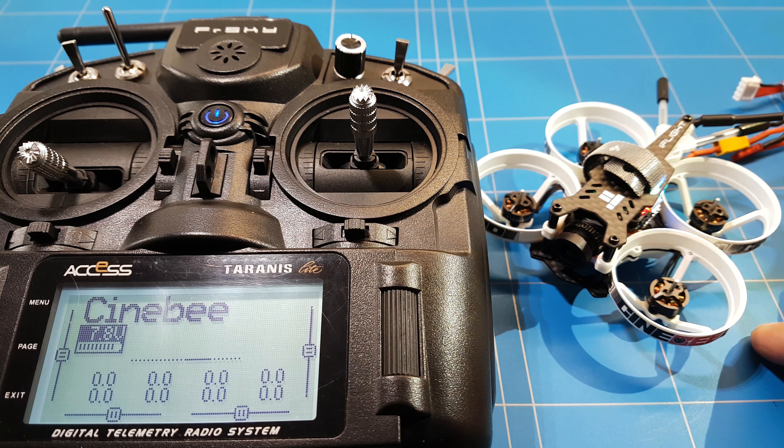There are a few warnings we need to follow. Because the motors are going to be spinning, the drone can take off if you don't remove the props. I recommend always removing the props when you are connected to Betaflight, because you never know what really happens when you are playing around with the throttle. When you understand all the risks, you click that little button — and nothing happens because the drone is not armed yet, so we have to connect the battery.